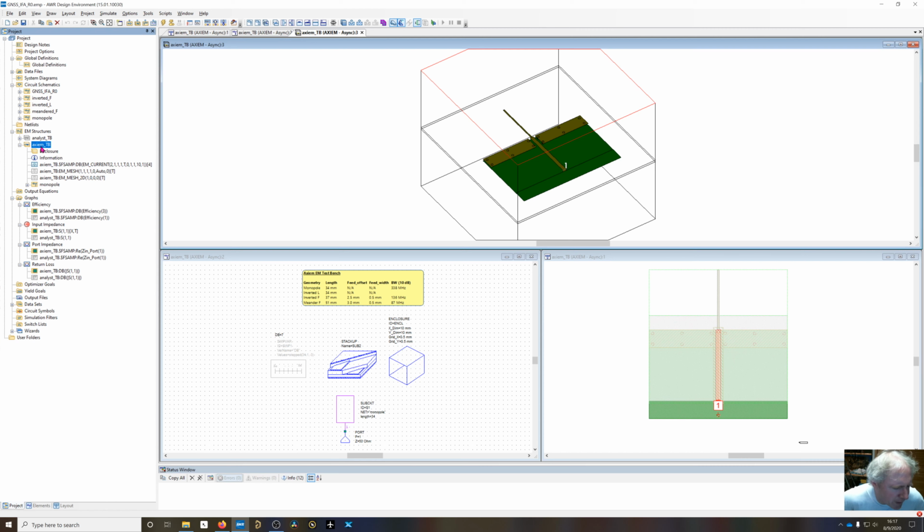So there's a couple different ways. There's probably about 4 ways of doing this, but if you're doing a circuit, you can use extraction. So you can draw your normal schematic layout, add an extraction block, and it will automatically toss that artwork into an EM structure, simulate it, and push the results back. And those EM results now essentially overwrite your circuit results, and you can directly see your EM results within that schematic.